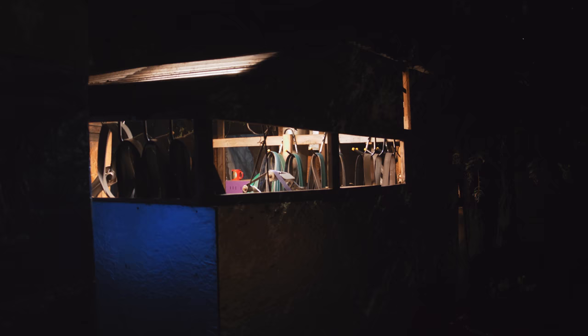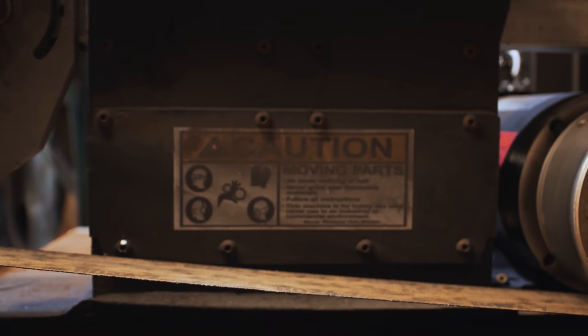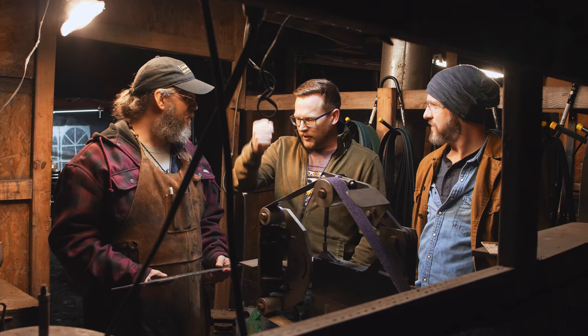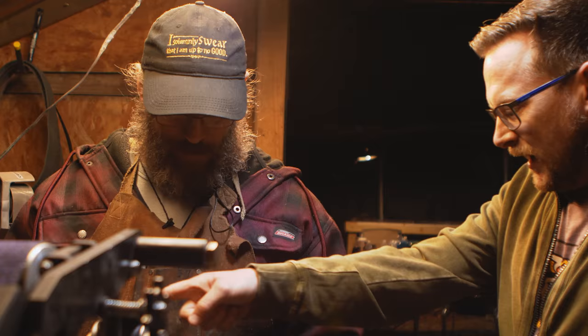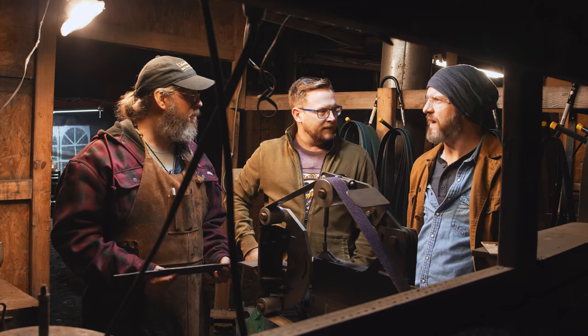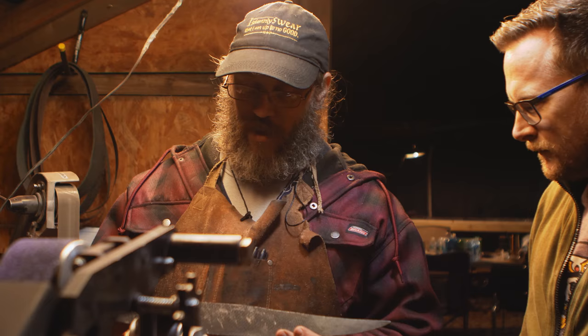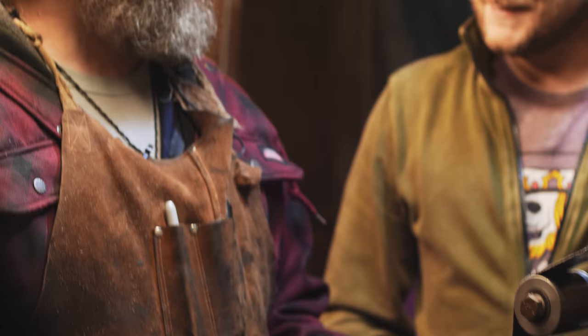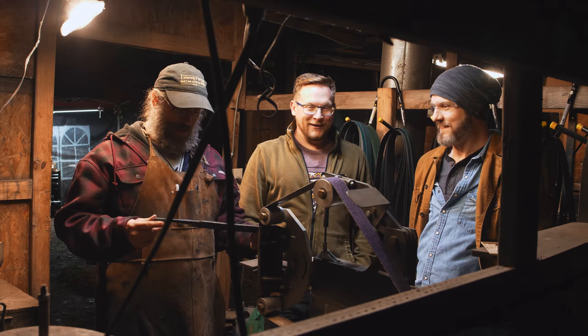All right, so we started with a rasp, we heated it, we banged it into shape, we heat cycled it, mm-hmm, and then, what was the last thing? We did a heat treat. We did the heat treat, put it in the quench, peanut oil, we quenched it, there you go. And then finally, you just basically defined the shape, right? Because it was a little bit kind of lopsided. You called that profiling. Profiling. Yeah. Cleaned up the profile a little bit, so now that we've got a pretty solid profile, I'm holding out hope we can do the mini baby Messer, but mostly this is going to be a big Bowie knife. I am so fine with a big Bowie knife. Names, whatever, it doesn't matter.